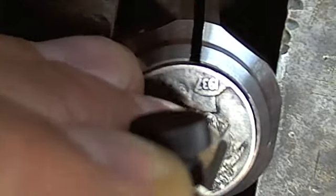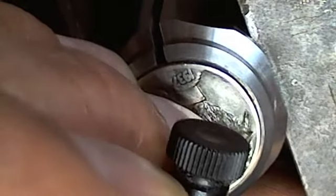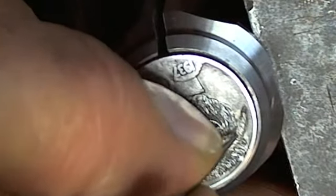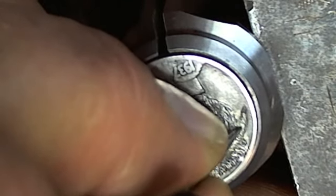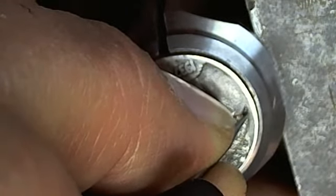So all these things that you see people doing with buzzing and moving metal, you do the same to smooth metal. And I'm just right on 90, like I'm going to hammer this into the metal of the coin, and I just hit this very small point and smooth out. Details, you just smooth and go into here and get little lines, just push and slide sideways. Add more depth to the whole piece.